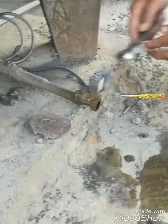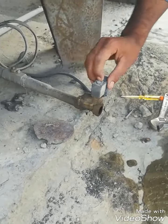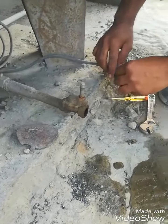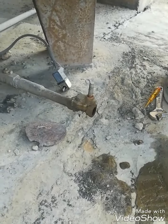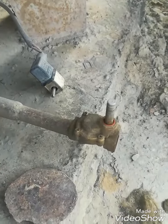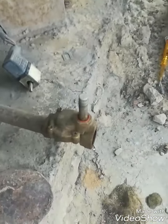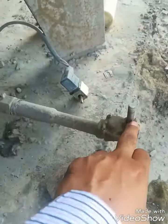I close the ball valve. There is a clip for the coil — I have removed the coil and put some metallic piece inside the coil so that if the command comes, the coil will not burn. This is just for safety. This coil operates on 220 volt AC, but we can also use a coil of 24 volt if we have a 24 volt supply.